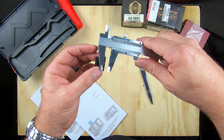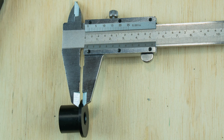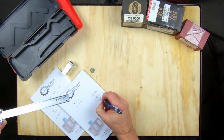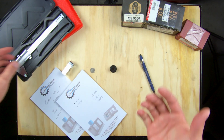Now let's measure the thickness of this relief — this counterbore edge on the part. We're going to lock that down. Looking at our scale, we're at one, two, three but not quite four, so not even at one hundred thousandths yet. We're between the third and fourth hash mark, which puts us at seventy-five thousandths. Then whatever we read on the upper scale — moving over until the lines align — looks to be about six thousandths. So seventy-five plus six thousandths is eighty-one thousandths, or 0.081 inches.